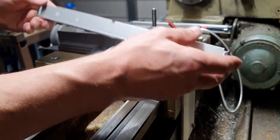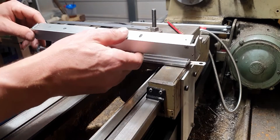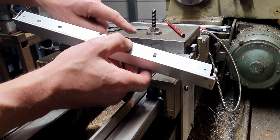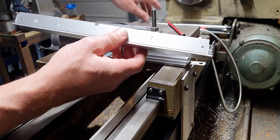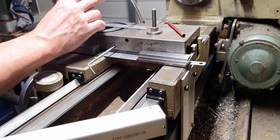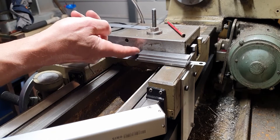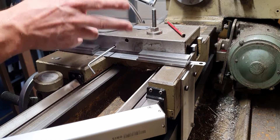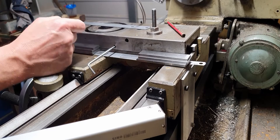I've also machined the new hole up here to screw further up. We can take that off, then drill those holes and get them tapped, then screw the bracket on and screw the scale on. Then all we've got to do is locate our holes in the lower part of the saddle and drill and tap those as well. I'm going to do all that off camera - it's really just a matter of drilling holes and tapping them, and I'll bring you back when we're about to assemble.